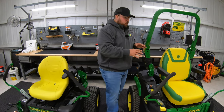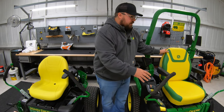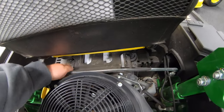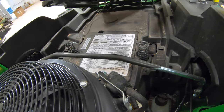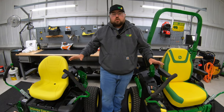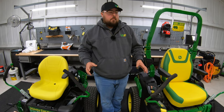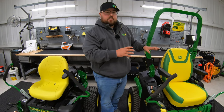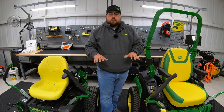On the Z5 series, you start at an 18-inch seat and move up to a 22-and-a-half inch seat, also with armrests. The Z5 features two-piece seats that can be changed out, and they also have a dual spring suspension system that is replaceable. A bar holds the seat down into place. Both seats are adjustable fore and aft to fit different operators, but the Z5 additionally offers the Comfort Glide system, which provides fore-and-aft suspension that works together with the up-and-down spring suspension.